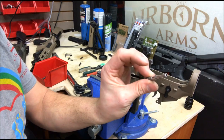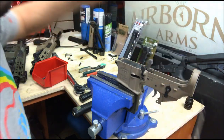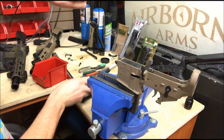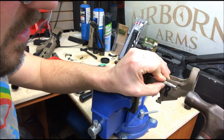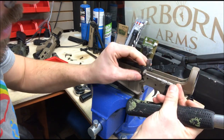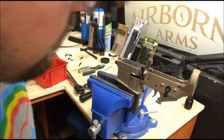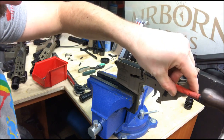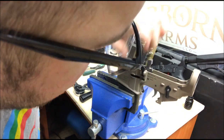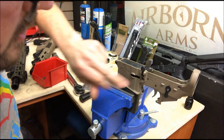Grab your detent pin and a roll pin starter. Dip it in just a little bit of moly lithium grease. Be very careful — this is where a lot of scratching comes into play when you're pounding it in. Do not scratch your receiver, especially a pretty one like this. Get it started and wiggle it down till it's flush — up to about there. Don't go too far or it's going to start hitting the back wall. I've got a nail set — you can get these at Menards. Get that in, wipe off the grease, then set it just a little bit past flush. You don't want it sticking out the other side though.